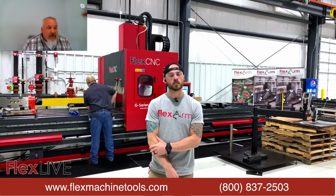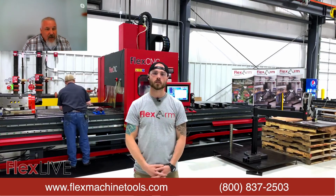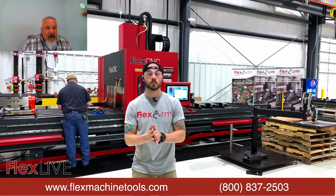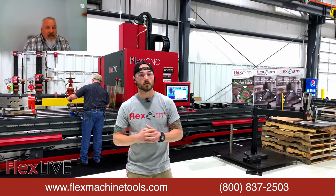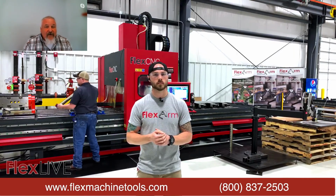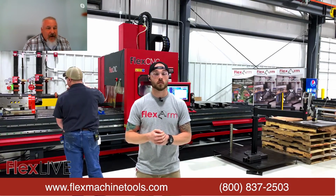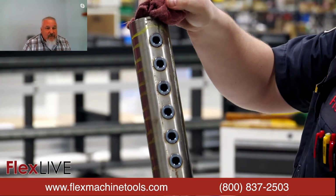Longevity of bits, typically in mild steel, we see 8,000 to 10,000 cycles. In stainless steel, that drops to 3,000 to 5,000. And then we've got some customers using aluminum where they don't change out for 75,000 cycles. So it just depends on your application, but we'll optimize it for you.